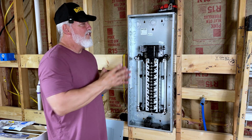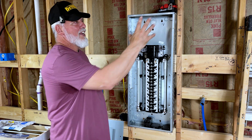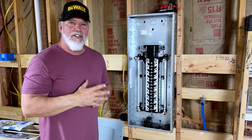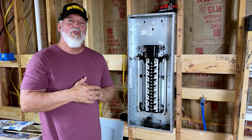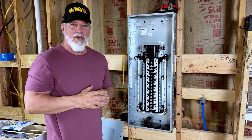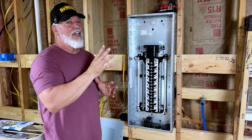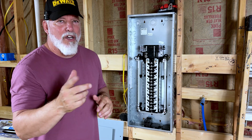The one we've got on the wall here is more of a service entry unit. You're going to have a meter on the side, with your power coming in from the pole going through the meter and in through the top. This is a single phase system. 99% of all residential units in the U.S. are going to be single phase, meaning they basically have three wires: a black, a red, and a white. In a business or industrial setting you may run into three phase, with a lot more than three wires — we'll talk about that later.